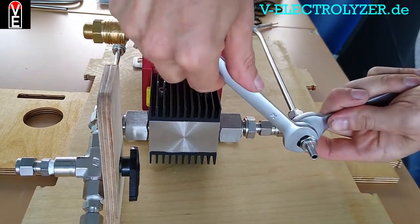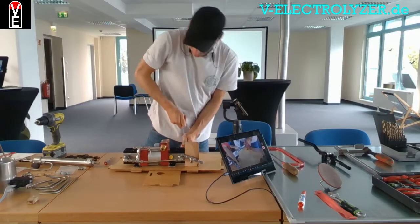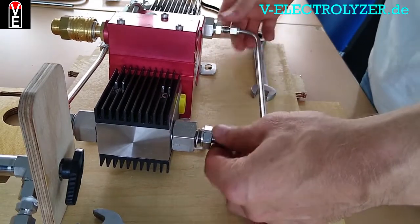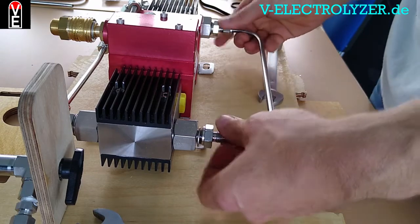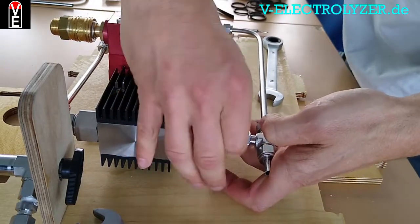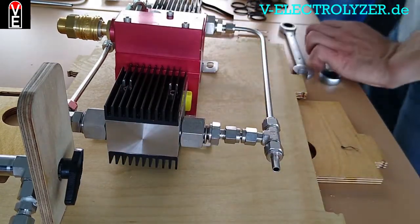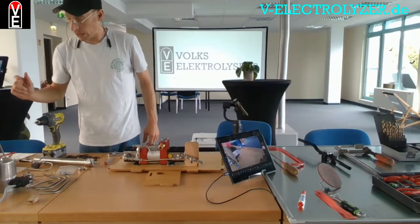I have marked myself all the depths of these pipes to get a good knowledge of how deep the initial pipe is inside the fitting. Please consider: this process cannot be repeated endless times, so every time you re-screw it you may have to push it a little harder.